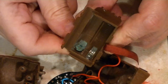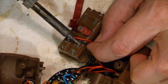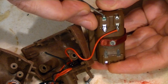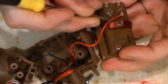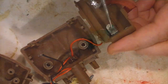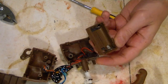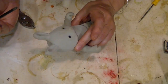I guess it's some sort of electrolysis type of thing, because it's always the negative that's corroded. So I'm going to de-solder this guy and I need to clear some of this solder out. I'm going to use my method — you heat it up like this and you heat it like that, and then you pop this here. And now this should come out. I like to use this stuff — it seems to work pretty well. Spray that in there and let it soak. You can see some corrosion around here, so I'm just going to spray some of that in there as well. While that's doing its thing, we'll move on to the Dirty Bunny.